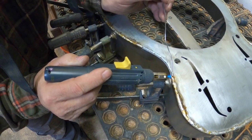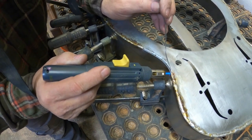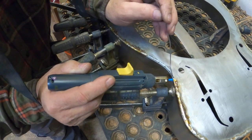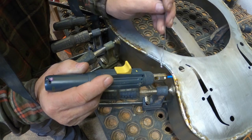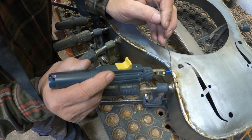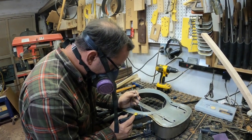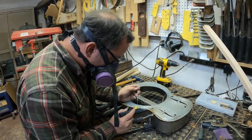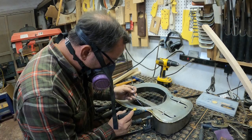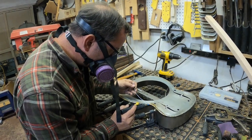I'm going to do a little voiceover here because there is something I learned during this process that I didn't bring up anywhere in the video or any of the commentary. Had I put the top in so that it protruded up above the top of the side just a little bit, an even distance all the way around, I could have made a nice round over with the solder, as opposed to, you can kind of see what I'm doing here. I'm filling a flat surface with solder and then sanding it off, and that's just not it. So I needed to raise the top up a little bit. I've got to figure out what that distance is and come up with a plan for making that a rounded over corner instead of a sharp point like that. And it all starts by raising the top and the sides.